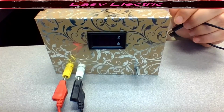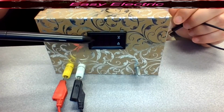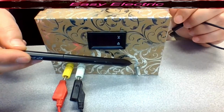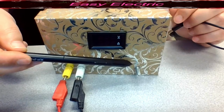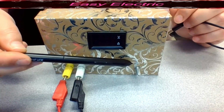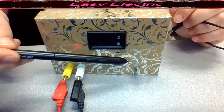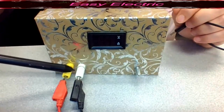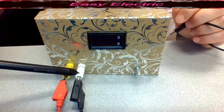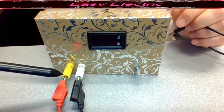So this is actually the circuit. We put the whole circuit inside one box. This is your voltmeter and ammeter. This is the variable resistor that we took out of the module and out of the box. Whenever you adjust this variable resistor, it adjusts the output voltage of the buck boost. And here you see the output of the buck boost module, which is connected to these 2 ports that can be used with any loads that we want.